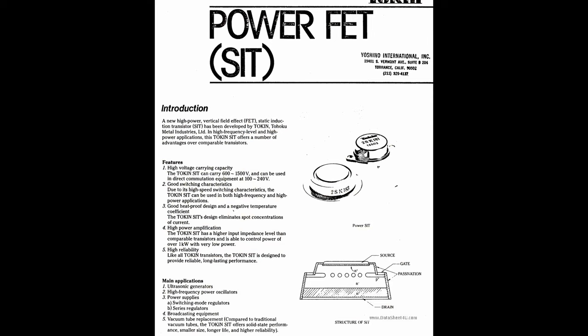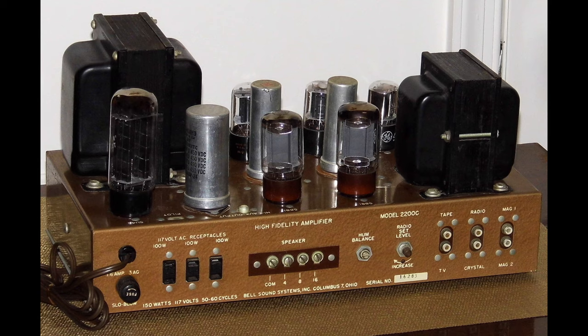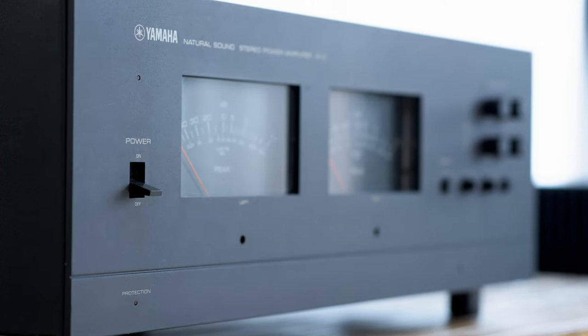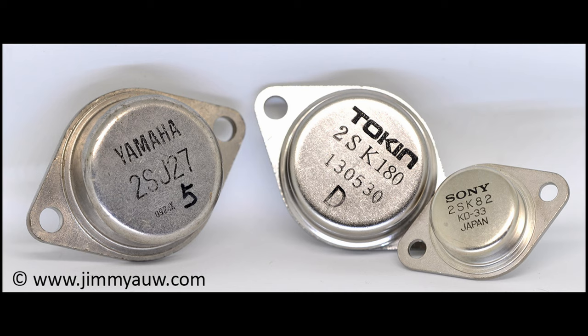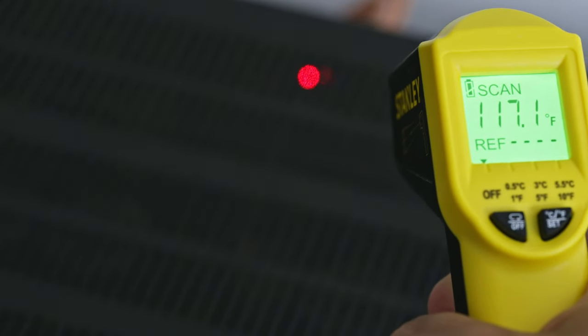VFETs have very low noise, very low distortion, and short turn-on and turn-off times. They say the VFET is as close to triodes as transistors get, and from what I've heard so far, it's true. These transistors produce very warm and sweet sound, but unlike valve amps, the sound is also very detailed. These are one of the best amps, period. The production ran only for a couple of years before everybody turned their backs on VFETs and started using much cheaper and easier MOSFETs and BJTs. VFETs can get quite odd compared to other transistors and need a very precise and flawless power supply, otherwise they may quite easily end up dead.